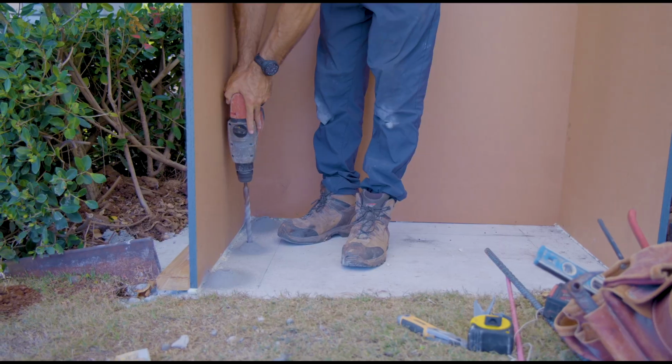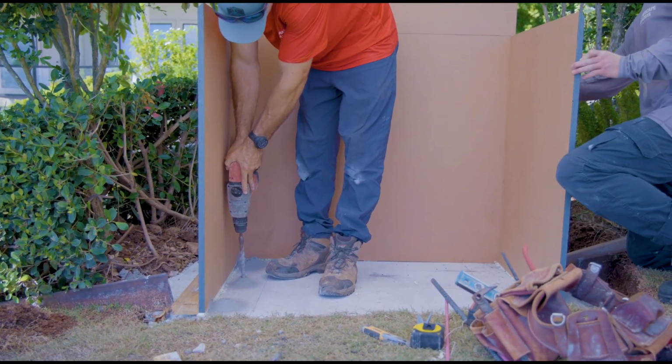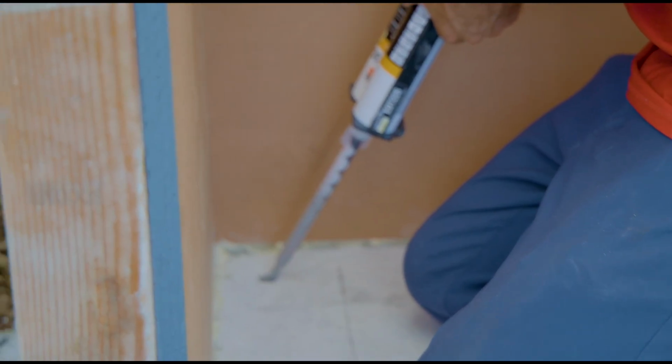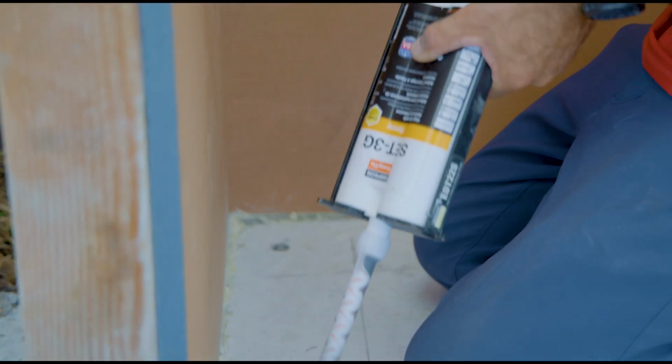We're using a combination of fiberglass and steel rebar on this job. Here we are drilling in our rebar dowels. I like to dowel after the footing is poured, just in case there are small changes or the layout needs to be tweaked a little bit.